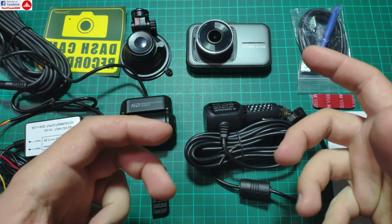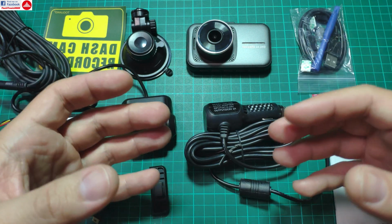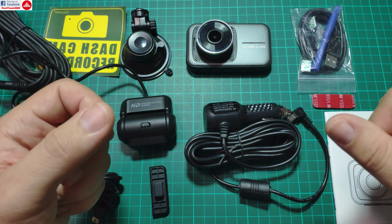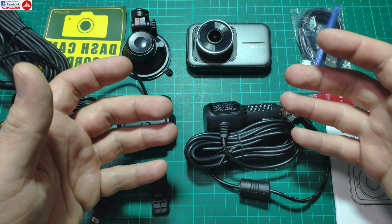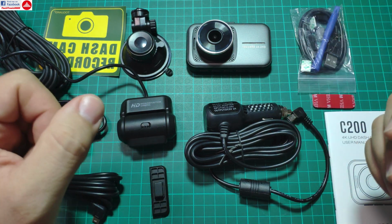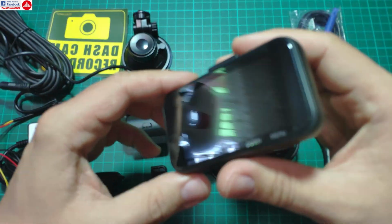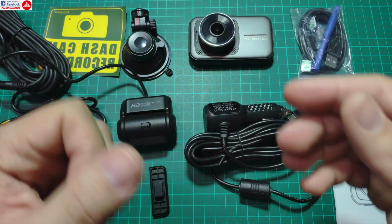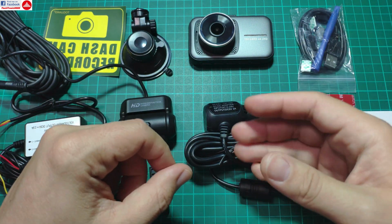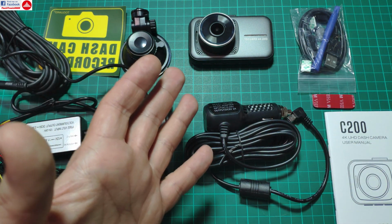It's from the Starvis series. This has a very good dynamic range. It has built-in dynamic range, also high dynamic range option. It's very good in low light and high contrast, but it's actually a 2.5K resolution sensor. It's not a fully 4K sensor. So this camera is labeled and sold as up to 4K resolution camera. Actually, it's a native 2.5K camera, and it has upscale technology to 4K because 4K sells better than 2.5K.